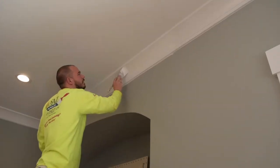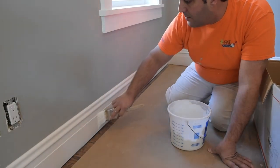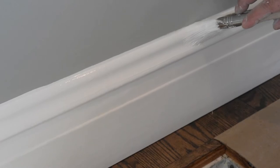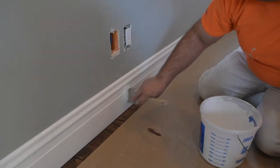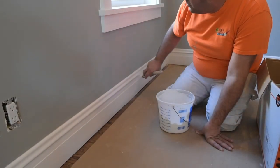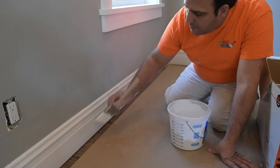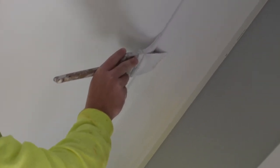Are we ready to paint? To the field! As we mentioned before, you may find yourself working with other trades on job sites, such as the case here. Notice how the floor protection doesn't meet the wall — that's because the crew installing the baseboard trim needed space for installation. But no matter the situation you find yourself in, proper brush technique is key. This means loading your brush with enough paint and not over brushing. You and your brush will sometimes be in odd angles, but if you remember to hold the brush like a pencil at the ferrule, you'll find you can get great results no matter what position you are in.